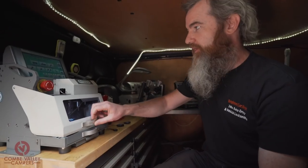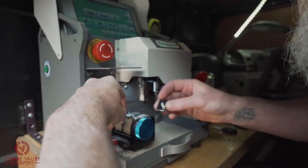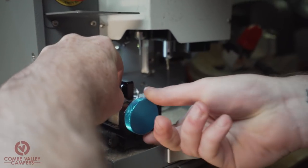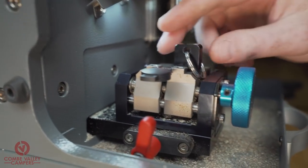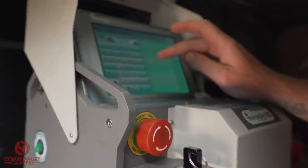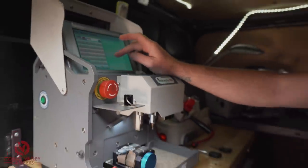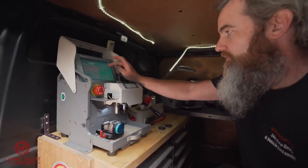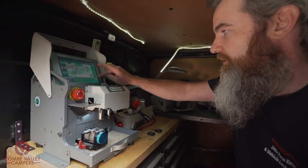What we're going to do is hand our keys over to Richard and he's going to walk and talk us through what is done to turn this into a decent key I can use day to day. So this is our Volkswagen key — we can see it's been cut, those are the cuts. We put it in the key machine in the right place; that's called the stop, and the shoulder of the key lines up to that. We know this key is an HE49 — it's a Silca reference. We only use Silca keys. There are seven cuts and four depths, and we're going to see what we get.